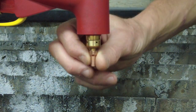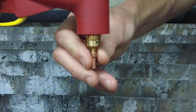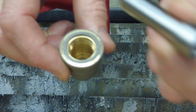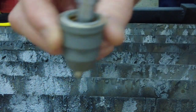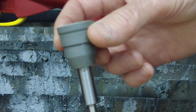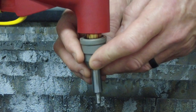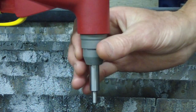Although the 82i electrode is a screw-on design, the EasyScriber does not screw on. Simply insert the EasyScriber into the retaining cap and reinstall the retaining cap back onto the torch head. The retaining cap will not screw on as far as it does with the plasma cutting consumables in place, and this is by design to prevent the parts-in-place circuit from closing.